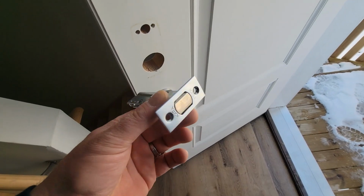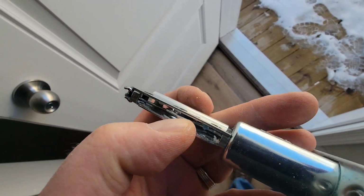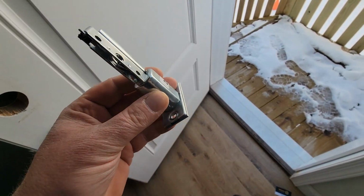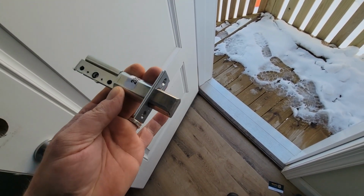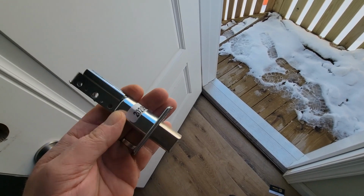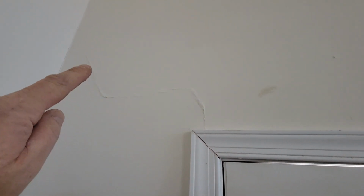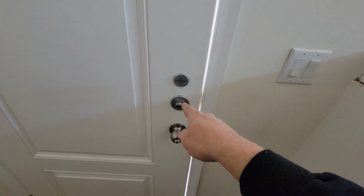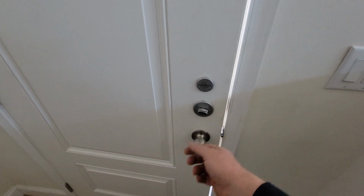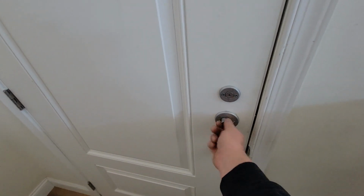We're moving on. All right, next door, same development. Bad Kaba latch. If you look at that, this is supposed to be straight across when this is locked, but if you hold this latch, watch this, in and out, back and forth. So we're going to change this out. All right, so this door is done now. Everything lines up good. See what happened here is, you can see from the snow load, it got on the door and pushed everything down and bound it up in the hole. And when they cranked on it with these new tail pieces, because they're like double the thickness, they're actually really rugged, it just stripped the latch right out. But now when it's done, it's perfect.